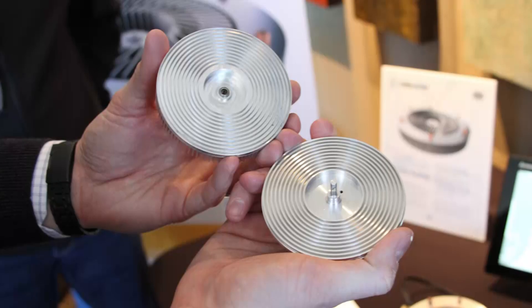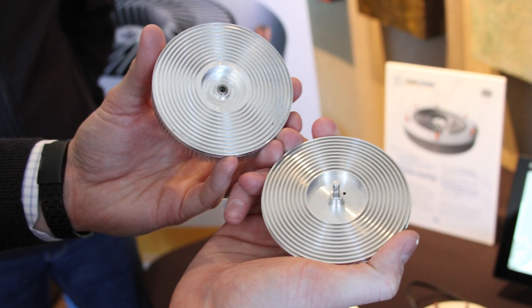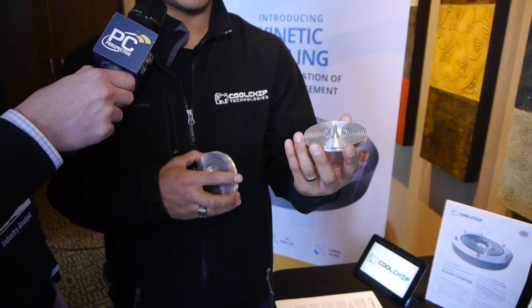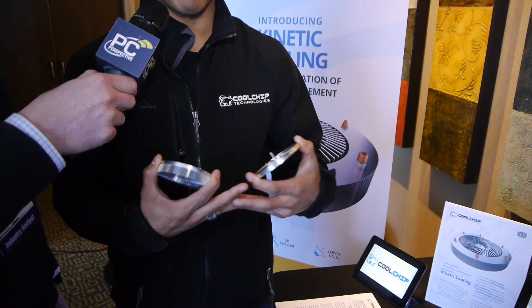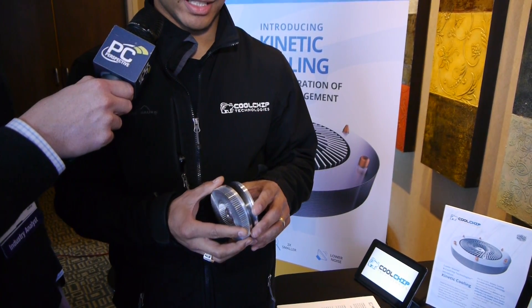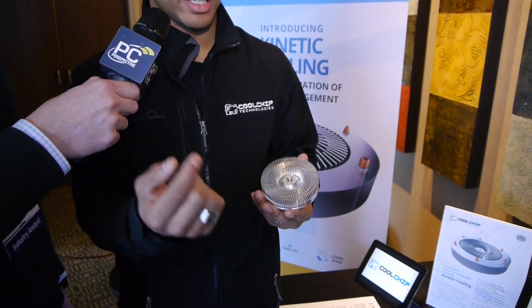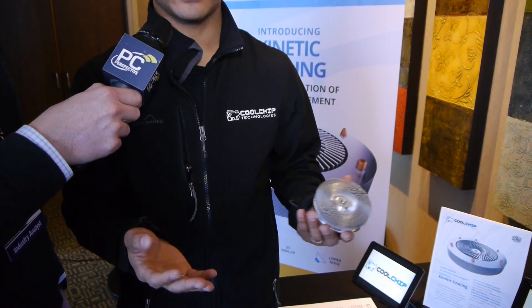Part of the reason why we can do that is because we've got more heat transfer surface area, so we can spin slower for the same amount of heat removal. The way we achieve that is by conducting heat from what sits on the processor — your heat load. This is the heat spreader stage. Through these grooves that mate together, we're conducting heat using a thin layer of air. Once the heat conducts through that thin layer of air and gets onto this rotating structure, this air mover takes care of the rest.